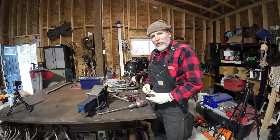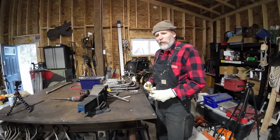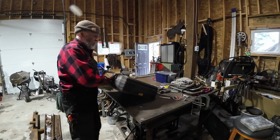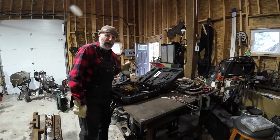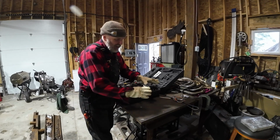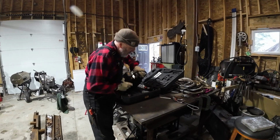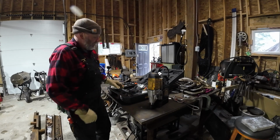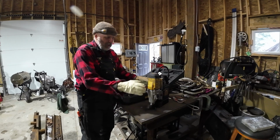You didn't think I was actually going to drill a 1/2-inch hole through 1-inch steel with this? Not a chance. We got a special tool for this job. Enter the mag drill. What a mag drill does is it's like having a drill press that attaches to metal. So this will go on here like that. We'll put a bit in it. We'll plug it in. It's magnetized so it holds to the plate so we can put it wherever we want.